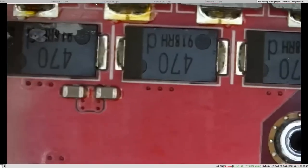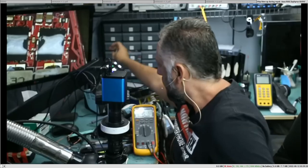So far nothing wrong with the board — no short circuit anywhere, all MOSFETs measuring good. My take: MOSFETs can fail, yes, but we have the 19V power rail present, so there is not much reason to suspect a shorted ground on this rail. A short on a secondary power rail is possible, and the best way to start checking is to have in mind the power sequence and the various power rails on the board. Rather than checking MOSFETs randomly, you should check the inductors. Inductors will always be a source of a power rail — that's a good checkpoint. Also remember: some power rails are low resistance by design, especially around CPU, GPU, and chipsets — newer GPUs can measure below one ohm.